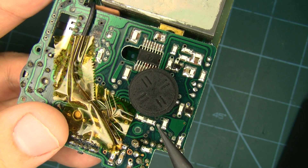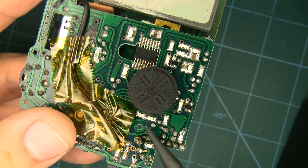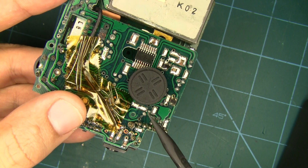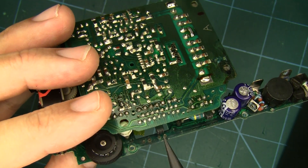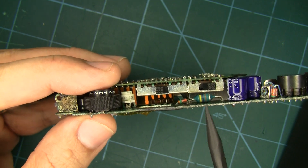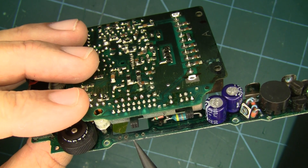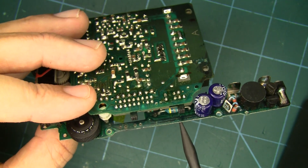The difficulty with these things is the desoldering, because for one reason or another they resist being desoldered — you cannot transfer heat or melt the solder down with the soldering station, and it becomes a problem to lift the component from the PCB. I already tried two capacitors located here, and it was a challenge because this PCB is thinner than standard thickness. It took me 10–15 minutes to slowly work my way and lift these from the board while keeping the traces intact.